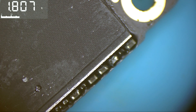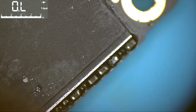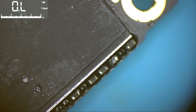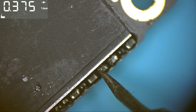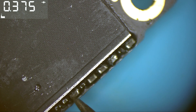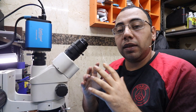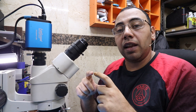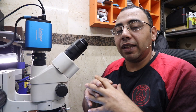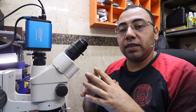The 3V power supply is there. Let's disconnect the battery and check diode mode. pp2v6 is okay, and 0.9V is also okay. 1.8V IO is also okay. There's no short, the power supplies are okay. So maybe it's the NAND itself or CPU.